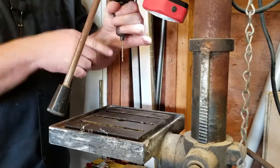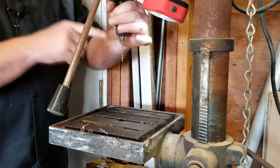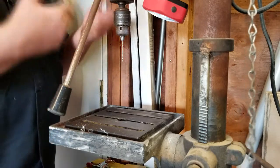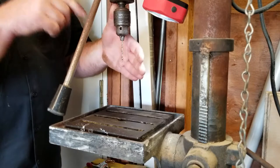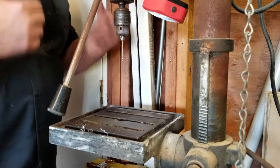Always a good test: turn it on and look at your bit to make sure it's not wobbling at all. If you notice wobbling, there are two reasons — the chuck may need replacing, or the bits themselves are poor quality. These are Harbor Freight drill bits and they aren't the best quality. But the tips I'm presenting will also help you buy cheaper bits and make them last longer, rather than spending on a huge investment in really expensive bits.